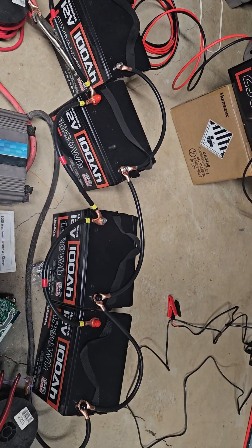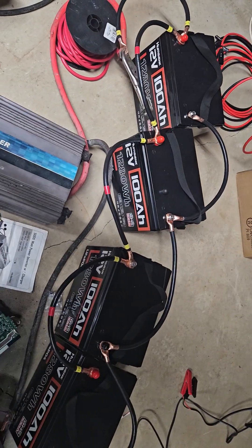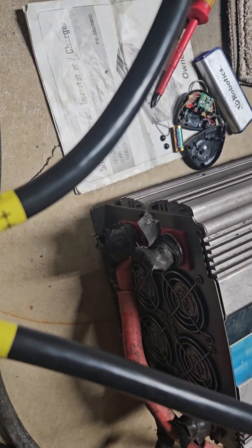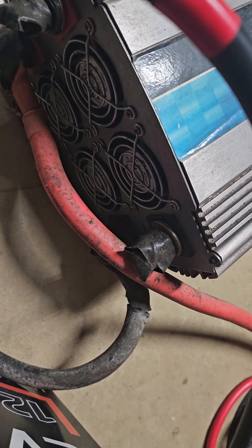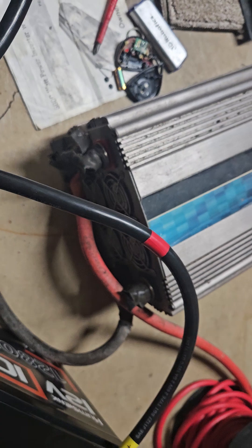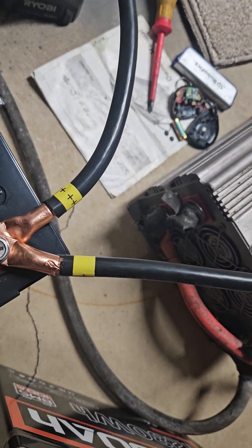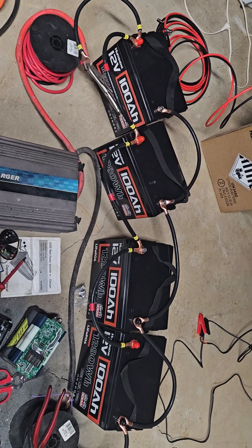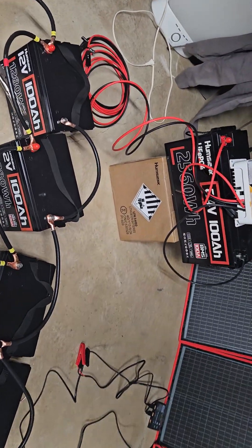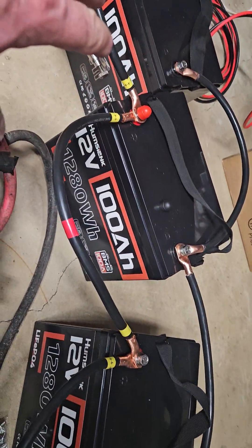So I've got four 12V lithium batteries — still equals 12V — because that is all that can go in the back of this inverter. The inverter does have two sections where I can put another plus and another minus, so I can take a 12V here and a 12V down there. Two 12s in parallel would be 12V, which gives me longer runtime when we lose power with more batteries. You want it in parallel so it remains 12 volts no matter what. They have to stay four 12s. That big one right here is a 24V lithium battery — you can't put that in place of two 12s along with two 12s.